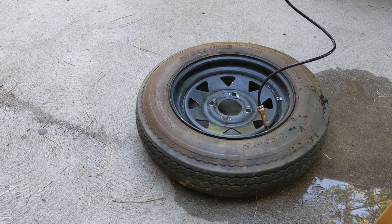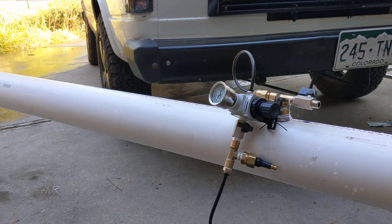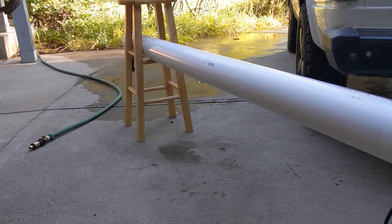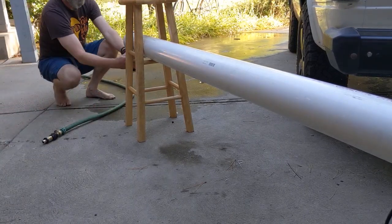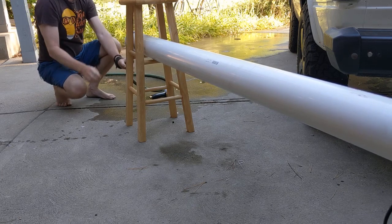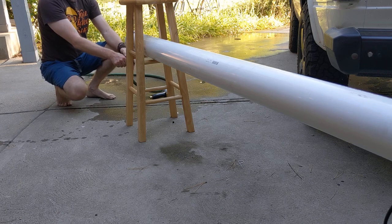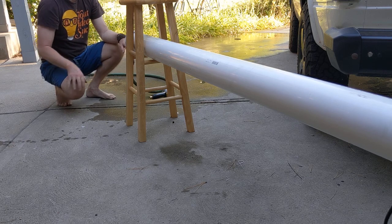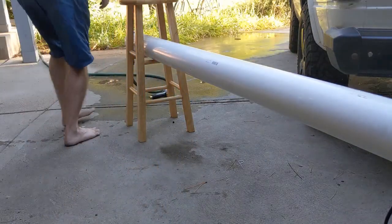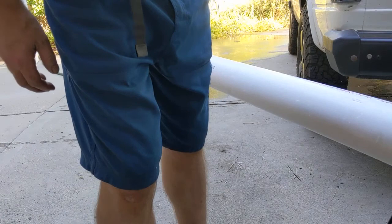Personally I always carry a little trailer tire with me because I camp with a small utility trailer. That little tire at 60 psi is enough — a little bit more than enough — to work with this seven-gallon tank. Here's how it works: air is off, the breather is open. Attach a hose, open the valve, open the water and fill it up until it comes out. That's why the breather is there — if it wasn't, the water would get trapped and you couldn't fill it.